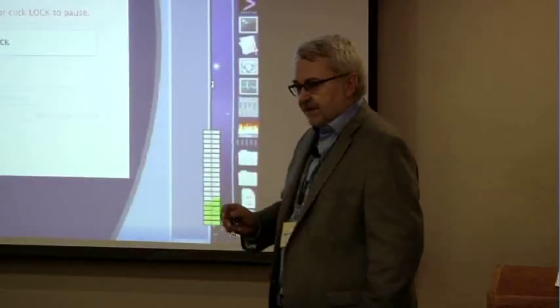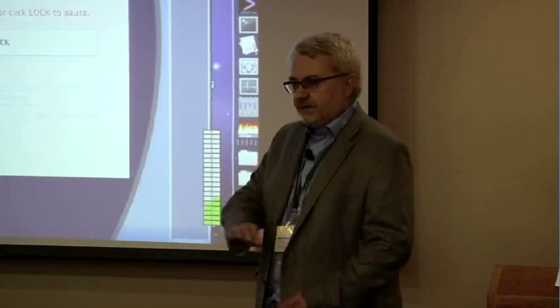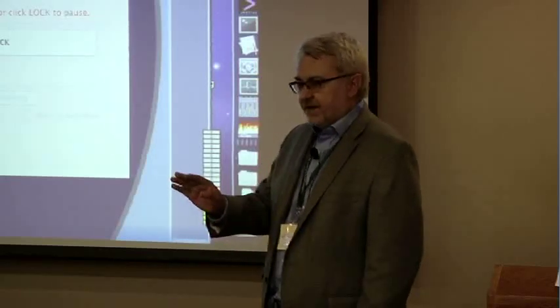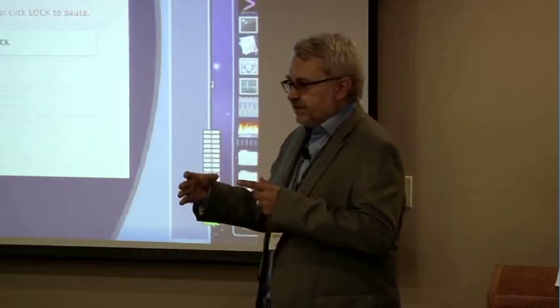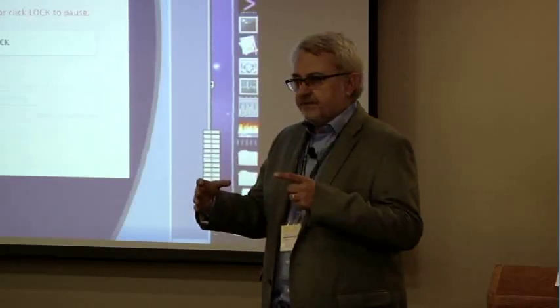Now, that's normally done in a phono stage. Every phono stage that's manufactured, just about every one except ours, has an RIAA circuit built in that applies this special EQ curve that was standardized in 1955. That's why it's called RIAA, because they became the standards body that said everybody's going to use this curve from now on. Before that, there were dozens and dozens of different curves. Rather than do that in the preamp, and this ties into your question, this device is made for home recording. It doesn't have the RIAA curve built in.